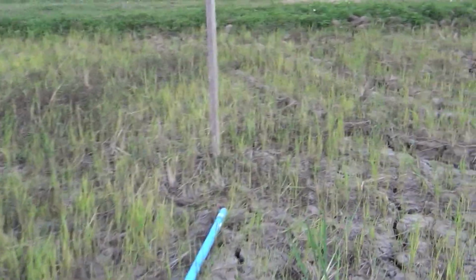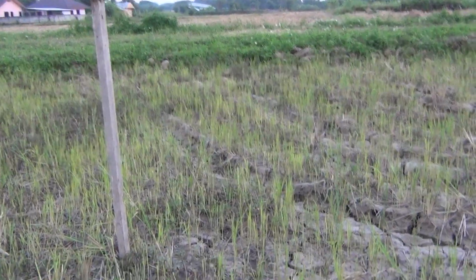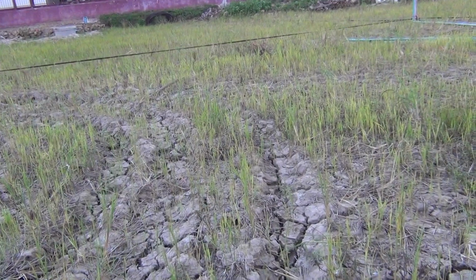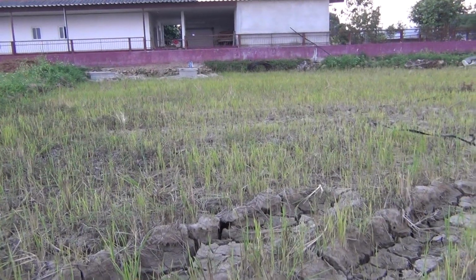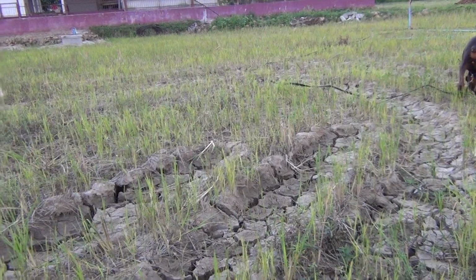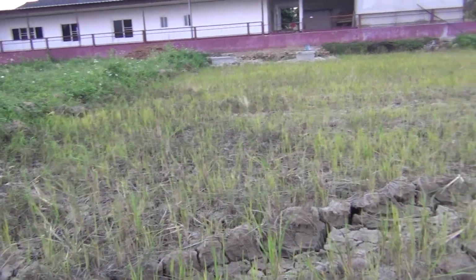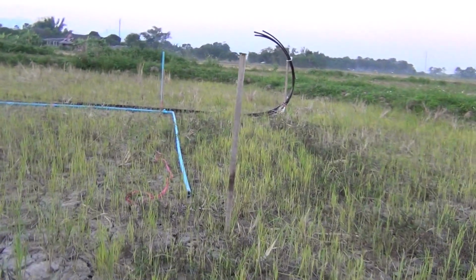It'll come down this way. But I'm gonna have to get one more 1 inch, because I'm thinking this was going to be the termination here and the garden being here. But what I didn't take into account is this is road. No, it'll be okay. I'll attach one more 1 inch this way, which will bring it somewhere to here, and then this will supply 3/4 inch water lines to each of the garden beds. Yeah. Okay, so we'll continue with this and see what happens.